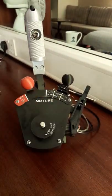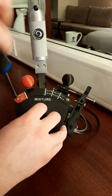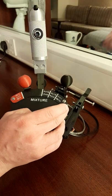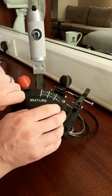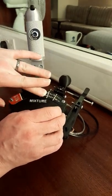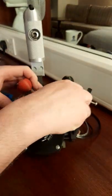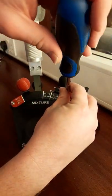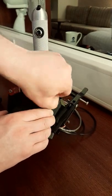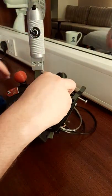I'll take this nut off anyway. Just make sure we're in camera. Then these screws come out. So this label actually is slotted so you can adjust where it moves a bit. It doesn't need to be adjusted really, because it's all going on parts made to fit it, but you actually have a little bit of adjustment if you really want it. I don't think it's necessary, but it was in the original, so it's in this one. It's also why a lot of these labels on originals are broken, because they're only thin aluminium, and where the slot is and the screw does up on it, it'll all crack round here and fall to bits.